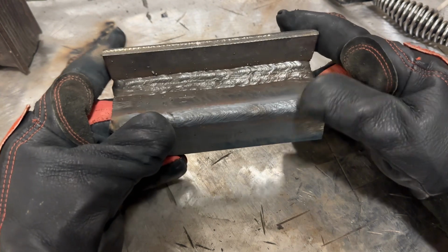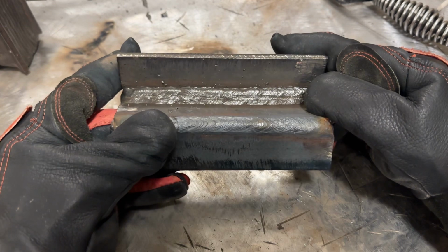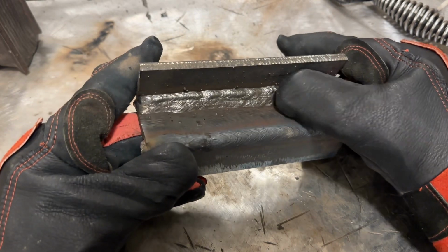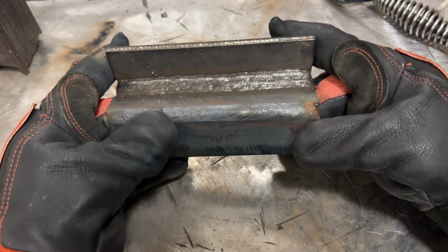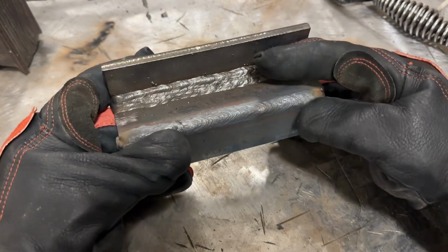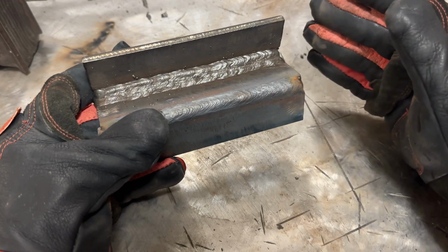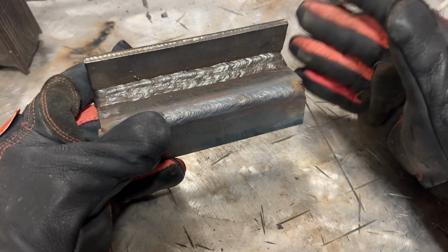There really isn't much of a reason to, simply because, for one, too many passes, and two, I find that welding this thick a plate, you tend to get colder toes, and you definitely can't say I wasn't running them hot. I had them at 105 for the root and 100 for going in there, and you're at the limit of what that rod can handle for amperage, and I can't boost more amperage because the rod was already glowing red near the end.